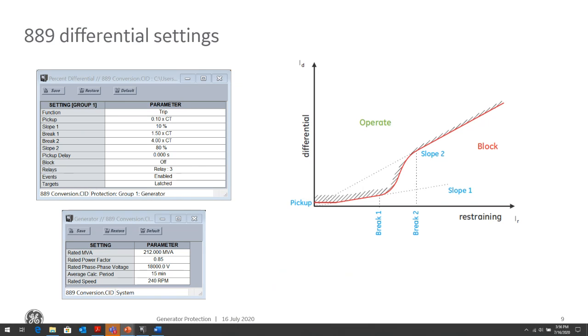Now, when we're talking about large capacity generators for ground faults, they're usually high impedance grounded. So with a high impedance grounded system, you can't set an overcurrent element as we've talked about. So there are some limitations there. And Terry, any other thing I missed?